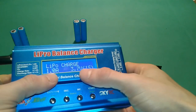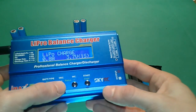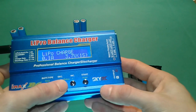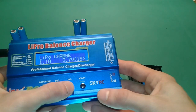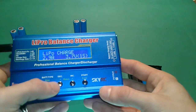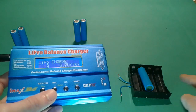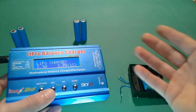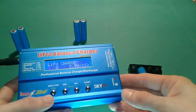You have some options here — this is the current, and this is the voltage. Hit Enter and you'll see it flashing. You can adjust the current using the left and right arrows. The minimum is 0.1 amps, which is 100 milliamps, and the maximum is higher than 1 amp. I recommend you divide the total current figure by the number of cells you want to charge. A safe charging method is to deliver 200 to a maximum of 400 milliamps to each and every single cell.